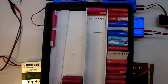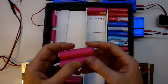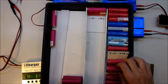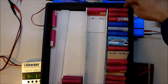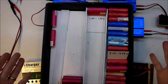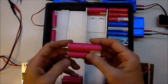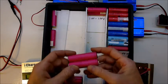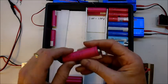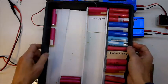Yesterday I showed you opening the actual laptop battery and dividing it up into individual pairs of cells, breaking down the brand and the voltage they initially read at, and sorting them from highest to lowest with zero volts down at the bottom. I'm also just looking for blindingly obvious problems — every now and then you'll get a cell that's all mottled and patchy, so I'm checking for those blatantly obvious bad cells.